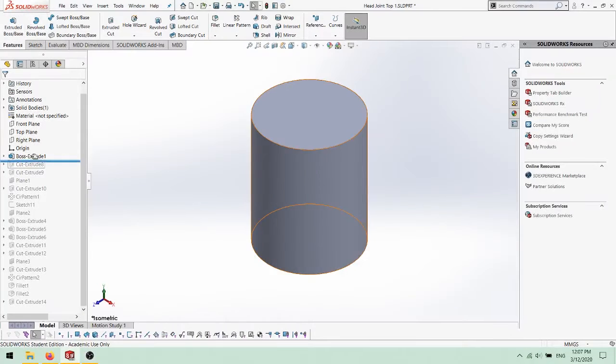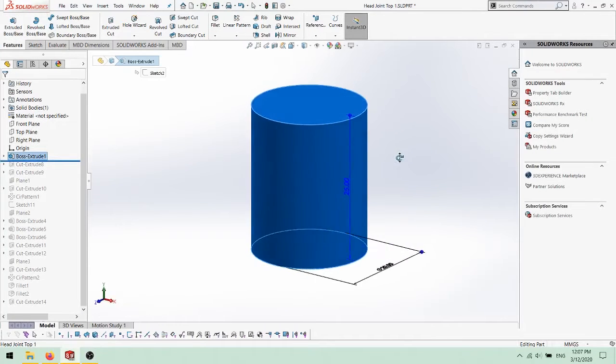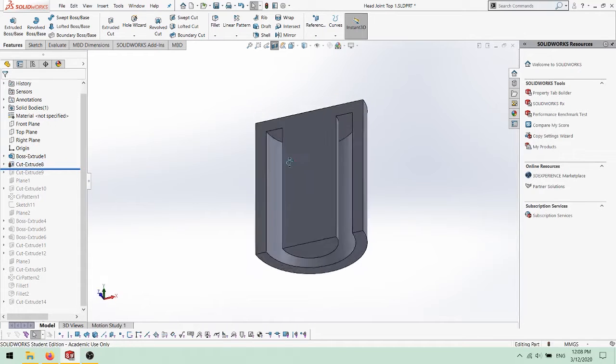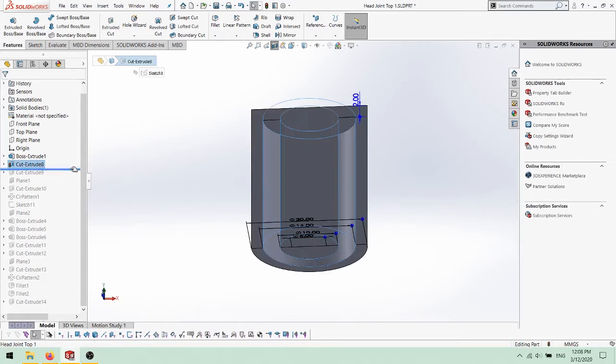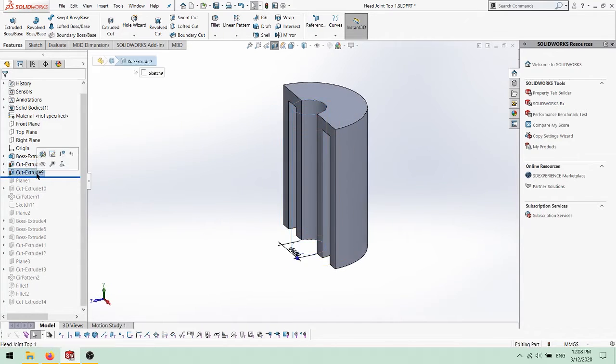This part was started with a circle 20mm in diameter, extruded into a cylinder 25mm tall. Next, to create the mate between the joint to headband part, a cylindrical section was cut out between 10 and 16mm, offset 2mm from the top face of the part. To fit the bolt, a 6mm hole was cut through the center of the part as well.